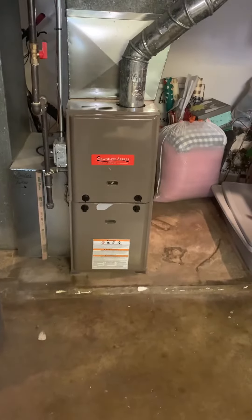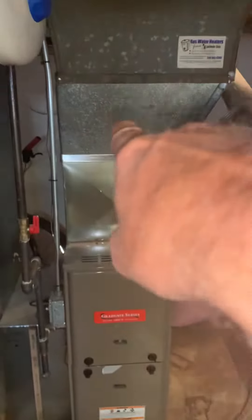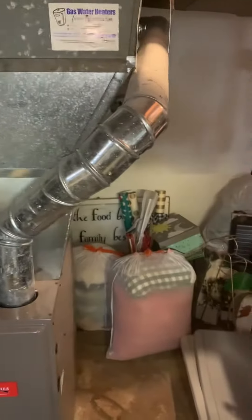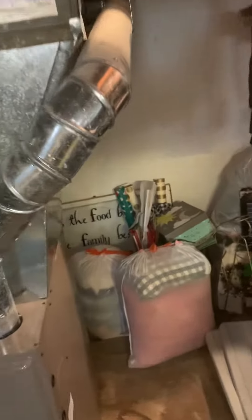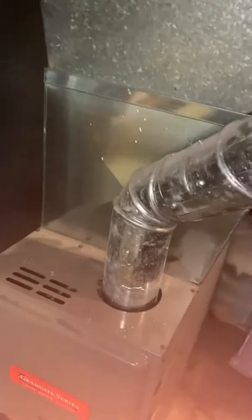Taking a look at a newer furnace — we're not replacing that, just looking up into this second slip and drive here, so that's 25 inches. We're going to get into a new coil and rework that small section. We've talked about a new condensate pump, and then draining and flushing the line set — both can be brought right in here wherever that coil ends up, or leaving it spun 180 degrees. Either way is fine.